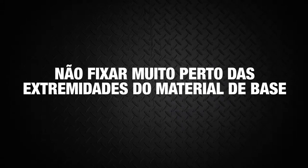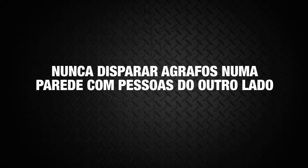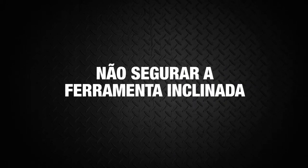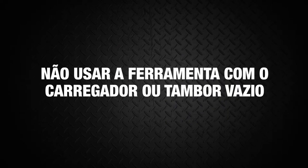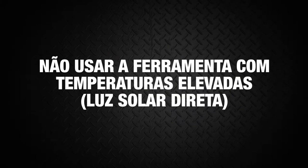Be careful not to fire fasteners too close to the edge of the base material, as this could cause breakout or fracture. Do not fire a fastener on top of another fastener — spacing can be found in the technical documents for the nails. Always check your surroundings to make sure nobody is working on the other side of the wall. Never place your hand over the nose of the tool. Always hold the tool vertically and never at an angle. Do not fire nails into materials that have been welded or worked with a welding torch. Do not use the tool with an empty magazine, in rain or very humid environments, or expose it to high temperatures such as direct sunlight.